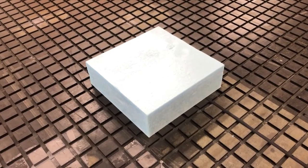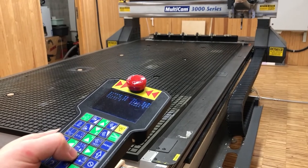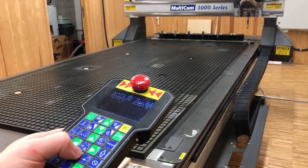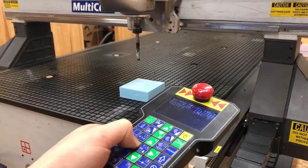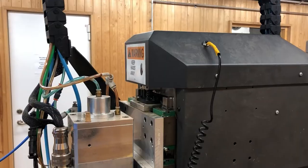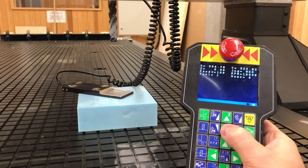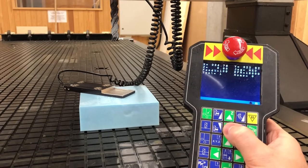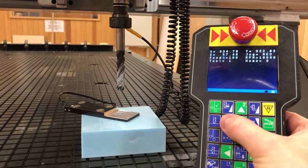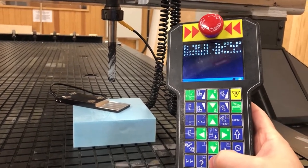Make sure that the vacuum suction is adequately tight. Jog the spindle so that the tool is positioned above the material surface. Gently take the calibration plate and position it on the material surface, then take the calibration magnets and put them on the tool. Jog down in Z so that you are about three fingers above the calibration plate. Set the surface using tool number one — hold zero to auto-set.